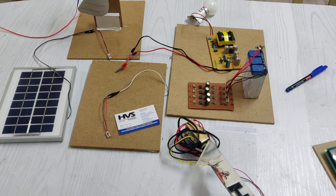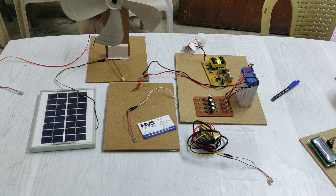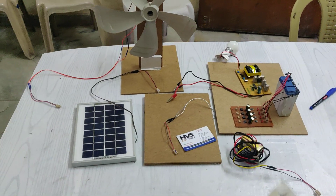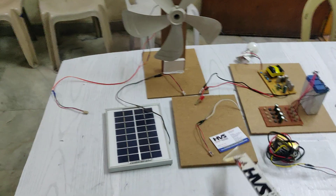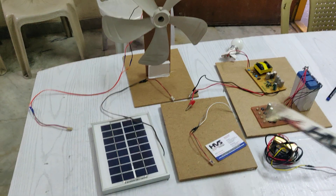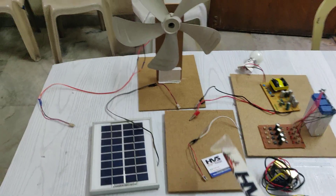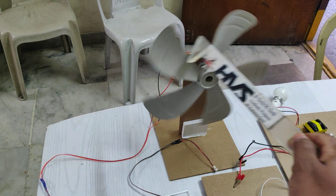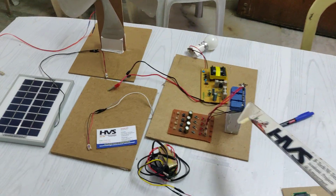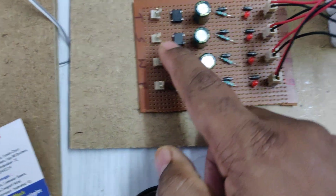Next is a 12V 1A transformer which takes AC input and provides 12V AC output. That output is fed to the battery pack through the charging circuit. So the ratings are: 12V 1A for the transformer and 12V 10mA for the piezo. The system converts mechanical force energy to electrical energy, sunlight to electrical energy, and wind to electrical energy. These are the sources used for battery pack charging.